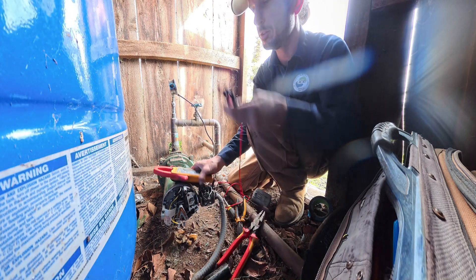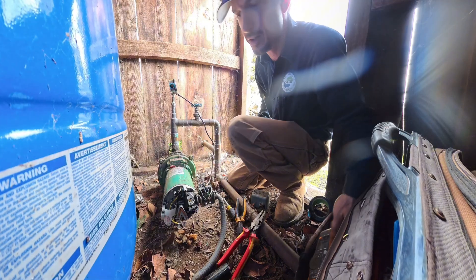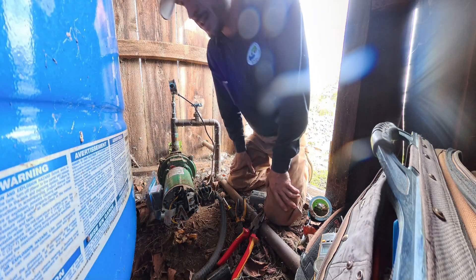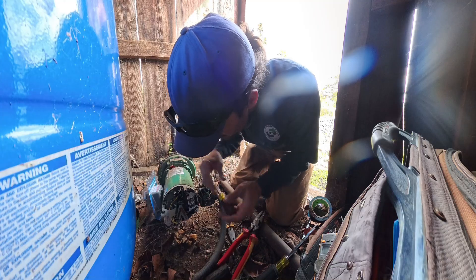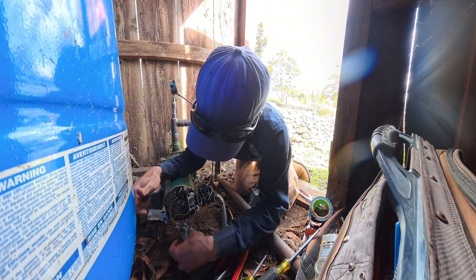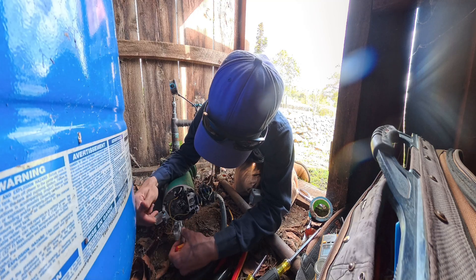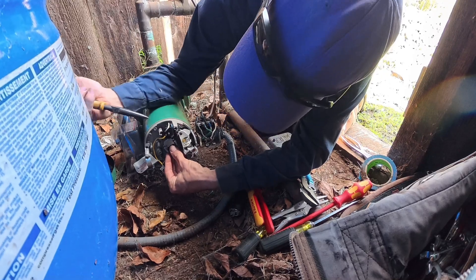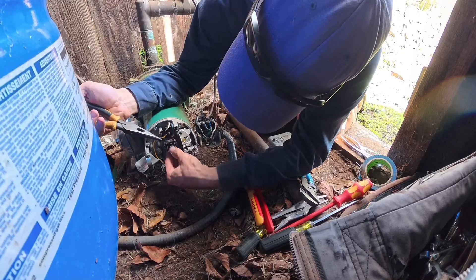While we're in here we should check that the shaft rotates. This is the centrifugal switch for the pump right there — as it spins, this weight flips up and that disengages this contact here. Yeah, this is normal — and then that's disengaged, so this whole switch has just come off its seat. Perfect, so shaft is not seized. The centrifugal switch is working.